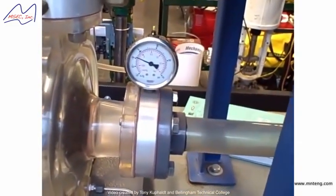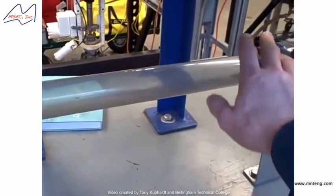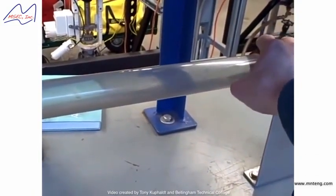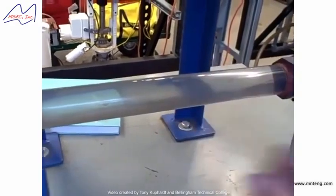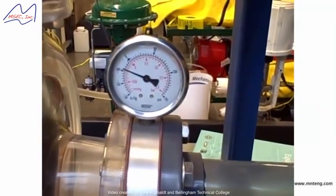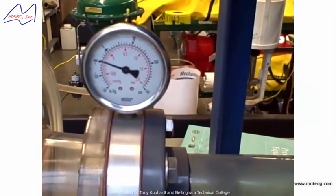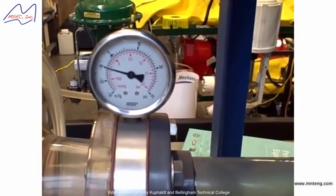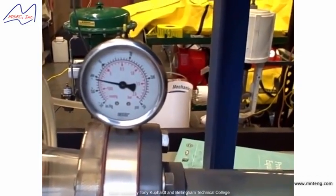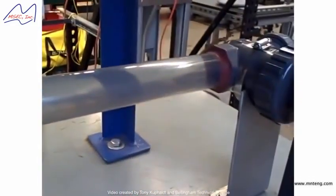You'll also begin to hear cavitation take effect. We'll be able to see the bubbles form inside of here as it cavitates — after it flashes into vapor and cavitates back into liquid. So here we go, closing the valve. Watch the gauge — it will go down. Minus 10 inches of mercury... minus 12... minus 14. You can start to hear flashing occur there.